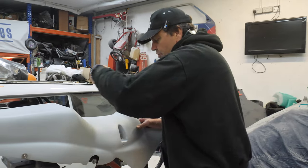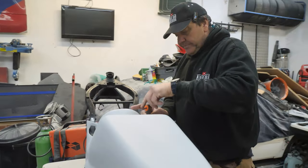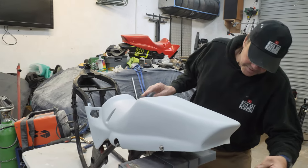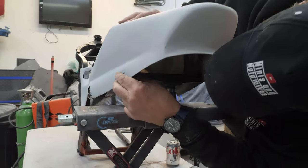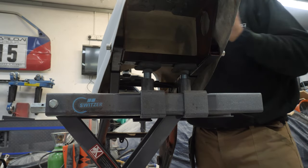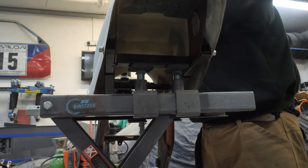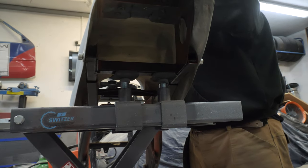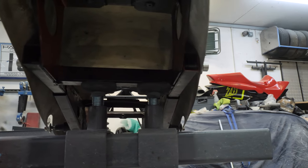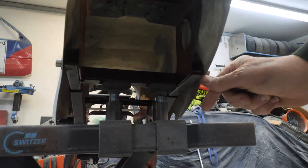So if you go sort of around it, you'll be able to see. But if I take it off, shall I take it off? Take it off if you want. If you look in there, I have tightened the cowl right up onto that bar, but you'll see that it is actually square in there now. It looks straight on there as well, doesn't it? There was a gap, wasn't there, and you were thinking about putting a washer behind it. Oh yeah, because it pulls that cowl in, and I don't think Ian likes that, so it still does need a spacer behind it.